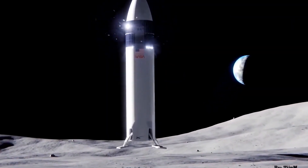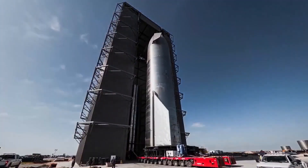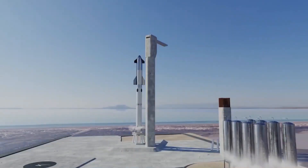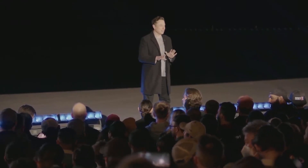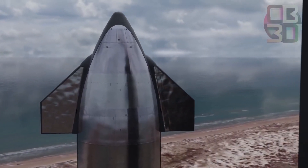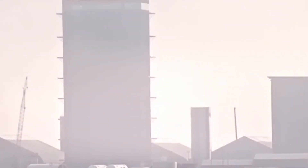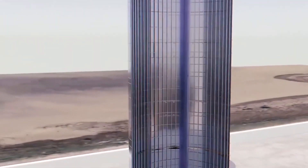However, there are already signs of some weirder changes being made to Super Heavy's design. On December 21st, a Super Heavy thrust dome — likely Booster 7's — was sleeved with several steel rings as part of a now routine process, partially completing the first 33-engine thrust section. Instead of the usual aft barrel section comprised of three six-foot-tall steel rings, this sleeve was made up of four 1.4-meter-tall rings, the first time in Starbase history that shorter rings have appeared on any hardware. It's entirely unclear what benefits SpaceX is getting from keeping a section the same height while adding more smaller rings, a process that will inherently increase complexity. Regardless, it's clear that SpaceX is in the midst of a significant period of design revision that could see Ship 24 and Booster 7 debut with a wide range of upgrades in just a few months.